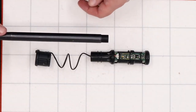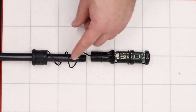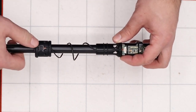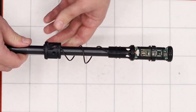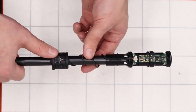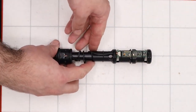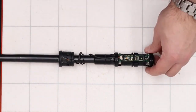With that done, bring back the barrel and slide the back boss over the end of the barrel, then feed the wires over the barrel itself. At this stage we can gently screw the barrel into the aluminium shroud housing whilst allowing the back boss to freely rotate. Just make sure the wires are nice and tight to the barrel — you can tighten them up at any time by gently rotating the back half of the shroud. To stop the wires springing up, fold the back O-ring over and hook it roughly over the middle of the wire.